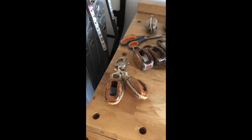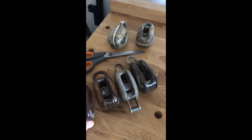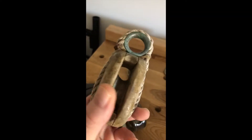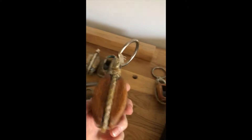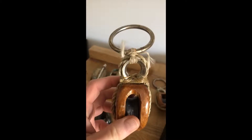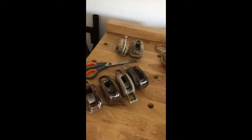Here are some small wooden blocks that used to be part of the rigging. Most of them are in fairly good shape and they appear to have bronze wheels with stainless steel fittings. The finish isn't so great and these ones here are probably the worst — the wheels aren't spinning. Basically I'm going to refinish these blocks and use them as practice for splicing on these wood-strop blocks, and some whipping. I probably won't use them in the rigging.